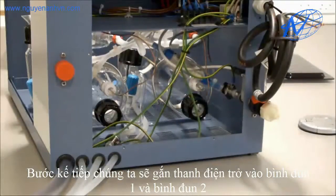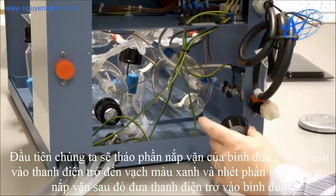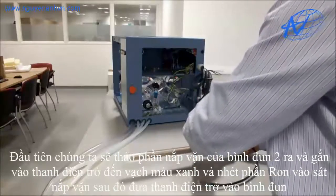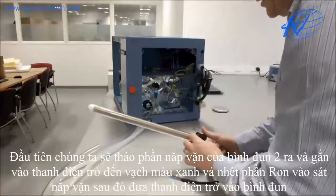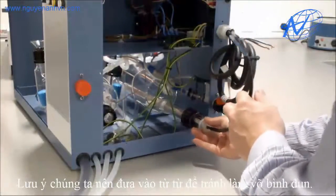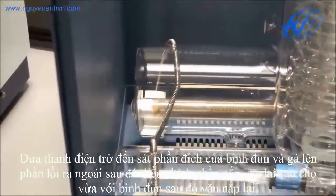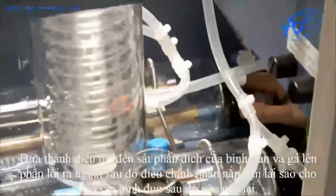We will then connect our heaters to our boilers — the rear one first. We take the black plastic cap off, then insert the plastic cap onto our heater. Inside the cap is the seal. We put this on and push it all the way to the rear until there's about an inch gap, then push the seal into the cap itself. Our heater is then inserted carefully, and the black cap is fastened up. The heater is pushed into the cut-out at the end of the boiler, and the end of the heater sits nicely in there. The black cap is then done up until hand tight — do not over tighten this as you could damage the heater. We then insert the front heater exactly the same way as the rear heater.